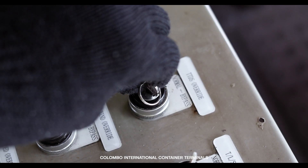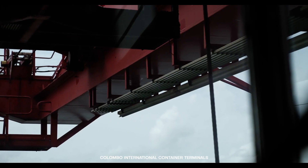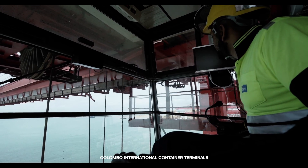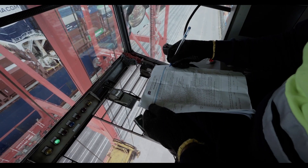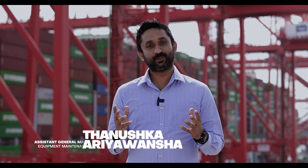Use the TTDS bypass key to slack the hoist ropes and check for any permanent bends. During operation, carefully inspect the SMG bus bar for any abnormalities, such as crow's nest. Additionally, pay close attention to any abnormal vibrations or sounds that may occur while trolleying.